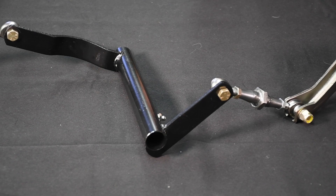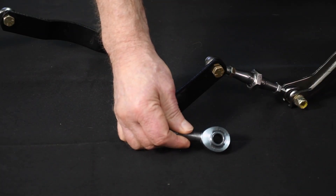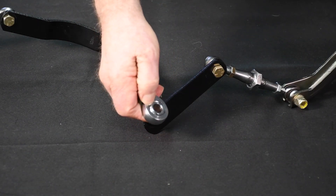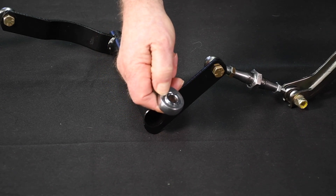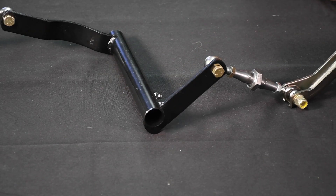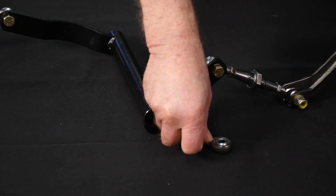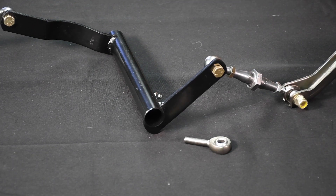So what rod end should you use? There are some big differences in rod ends. Many are made in China. Some are cheaply built by injecting plastic between the rod end ball and the rod end — this larger diameter job here is just an example. Some are built aircraft quality and they make use of three-piece construction. This configuration is regularly referred to as an aircraft rod end. I use made-in-the-USA Aurora rod ends exclusively and I prefer aircraft rod ends.